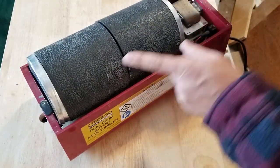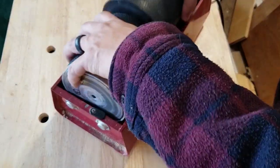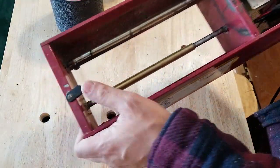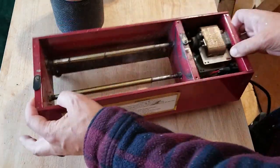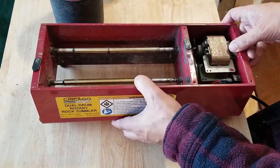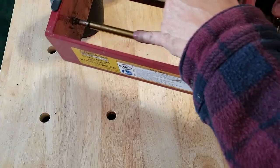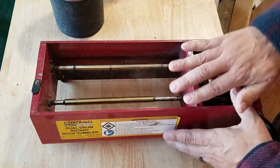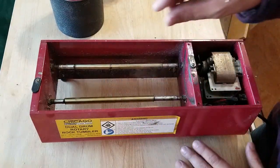The first wear point is how the drums crawl side to side and rub on this little plastic tab they give you. This will eventually wear out. There are a lot of YouTube people that complain, saying all you have to do is level your tumbler with a bubble level. But the key is these bars have rubber for friction, and even if it's perfectly level, after time, the barrels will still crawl.